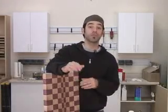With proper care and maintenance, your cutting board should give you and your family years of service. When the board starts looking really rough, just take it back into the shop, give it a thorough sanding, and simply reapply your finish of choice and the board will look like new.